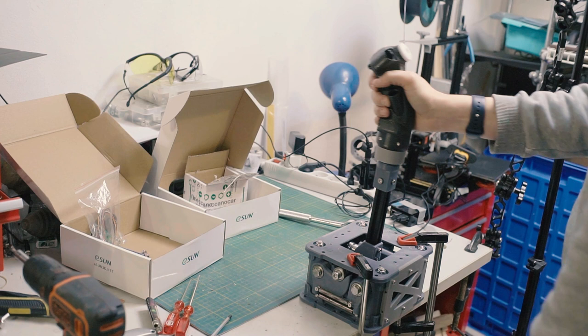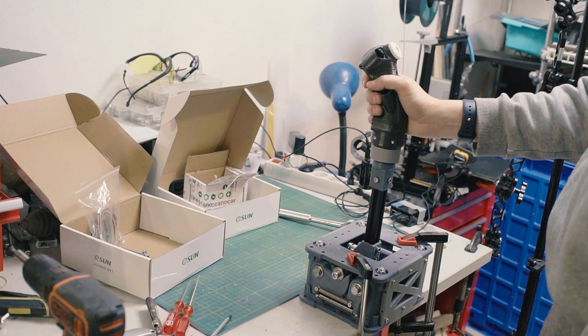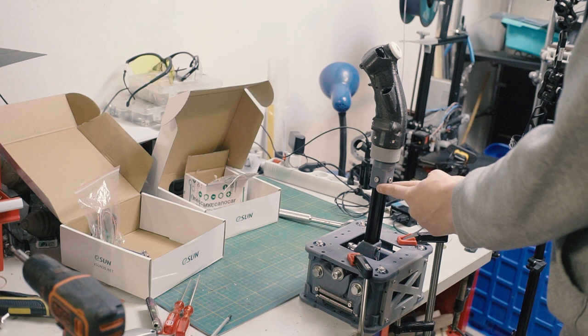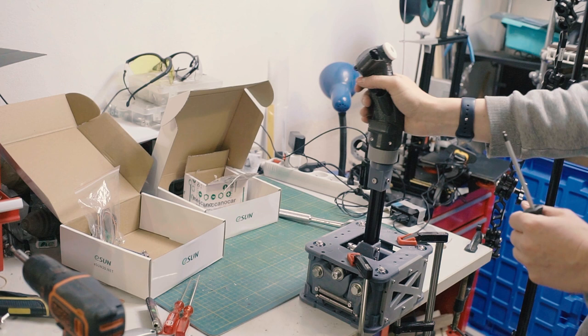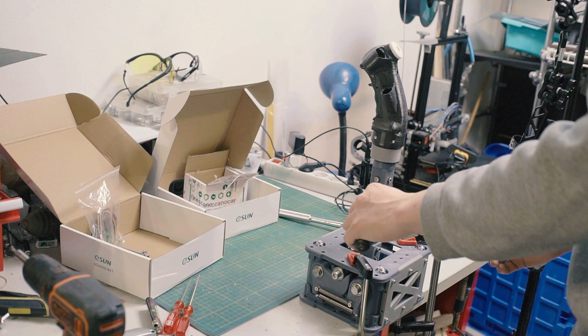Now with these medium cams, there is a degree of center, I wouldn't say detent, but you can definitely feel a hard center position. And actually, there's a creak there. You need to hear that bump. And that bump is actually this piece here. So I might adjust the design so that this extends down another, like has two holes instead of just one in the center like that, because just because of the weight of the stick, you can actually hear that? That's it. See, it doesn't do it front to back, and the reason why it doesn't do it front to back is there's two screws there, but here, there's just the one.